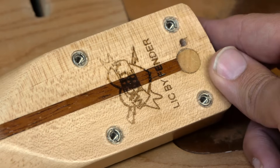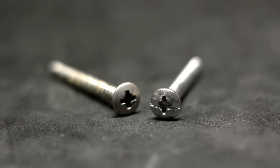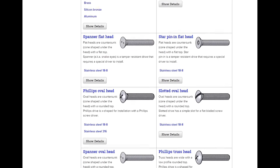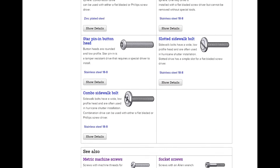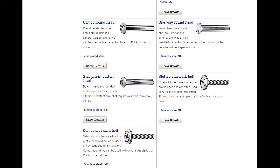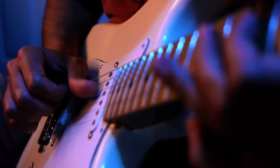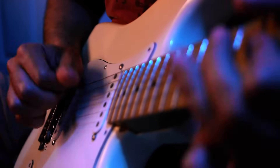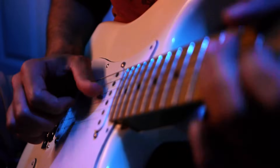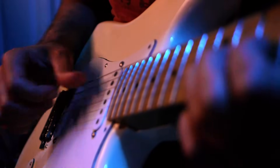After all the inserts are in, all that's left is to attach the neck to the body. Stainless steel machine screws of the same length as the original neck screws should work fine, and you can take your pick between pan head, oval head, slotted, Phillips, combination, Allen, or anything else. My intention with this video was to demonstrate the most accurate and reliable methods I can personally think of for installing them. Let me know in the comments section what your thoughts are about threaded stainless inserts, and what benefits or drawbacks you've found to using them. As always, stay tuned for more Guitar Everything, right here on GuitarMD.